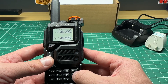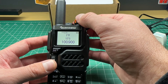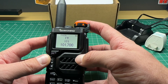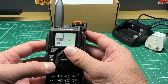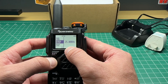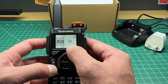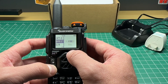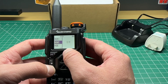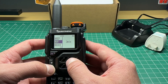There's also FM radio — I can press function and FM, which switches to the FM VFO, and I can enter directly the FM frequency I want. Going into the menus, they're all fairly standard and a little bit similar to a Baofeng. You've got your squelch, steps, transmit power, CTCSS tones, and everything you would normally expect of a radio like this. There were a couple of items I didn't quite understand, but when I consulted the manual, I realized what they were.